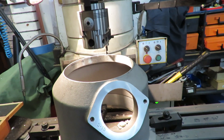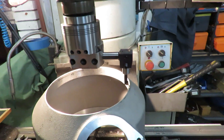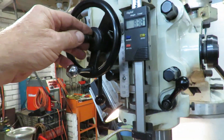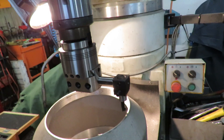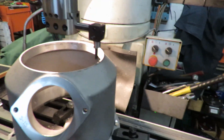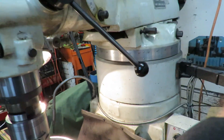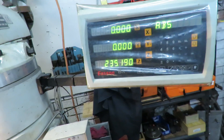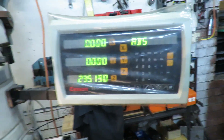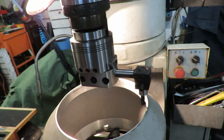So 15 hundredths of a millimetre is what we've got to do. We're taking out one lot and then we'll do the other. We'll be engaging the feed and we're running at about 200 RPM. Everything's locked up in place, all the tables locked, everything's all done. We're on zero on the DRO. So we'll fire her up and we'll show you that first cut.